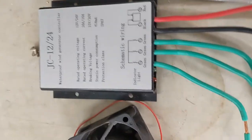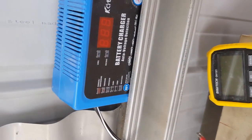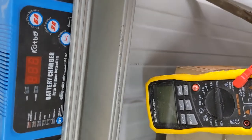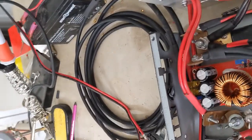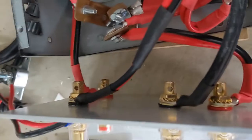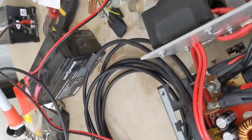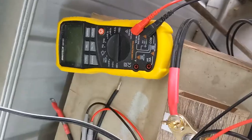The alternative is that when we get the automation all in, we'll choose whether or not to turn on the battery charger — I'm calling it solar, but it's the battery charger that'll run off electricity which, during the day, is coming from the solar. I do actually have a photovoltaic sensor on order. Theoretically both the wind controller and the battery charger could be connected and then controlled by a relay. The battery charger could be controlled by the automation logic to say: if it is daytime and we're getting no wind, there's no reason why you shouldn't charge the battery off the excess solar — assuming you've got excess solar.